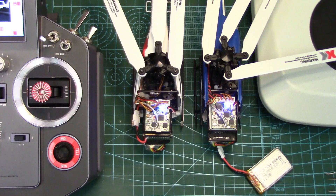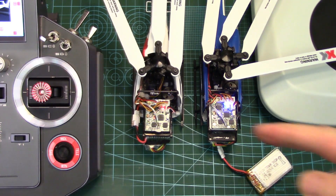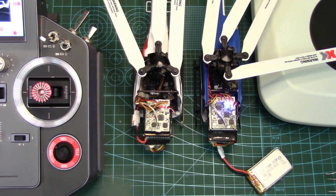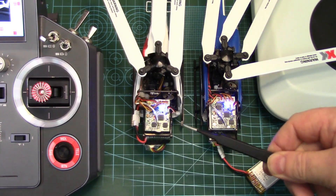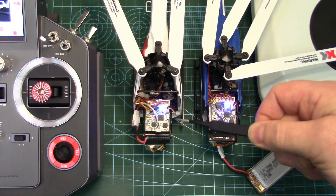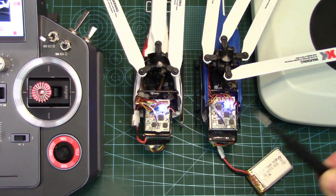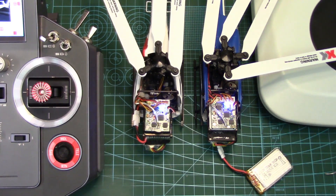High rates, self-level mode, throttle down, elevator down — and it's still entering calibration. The K124 is not. So I don't know what's going on. Obviously, as I suspected, that doesn't really have anything to do with putting it into the mode. That would probably have something more to do with the CPU. Something is preventing the K124 from going into calibration mode, so if anyone else has got a K124 that's not doing this, it would be interesting to know. Please leave comments below.